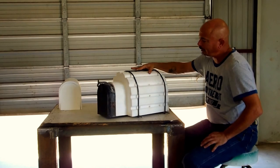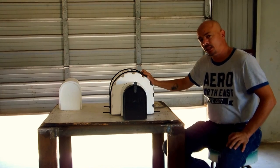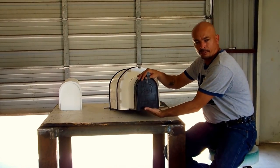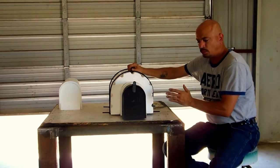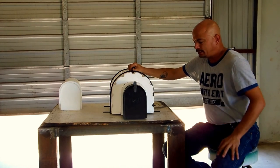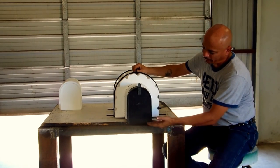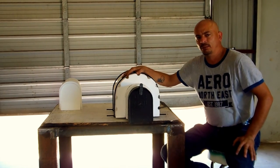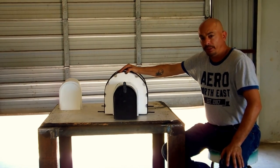We put weep holes in and you can build your brick enclosure completely hollow — no cinder blocks, nothing. There's no need to use that extra material any longer because this will hold your mailbox in place and it won't move. Once this is installed and the three-quarters of an inch of mortar is around the outside of the mailbox, you cannot pull the mailbox out until you take that one mortar joint out. If your mailbox is hollow and you put weep holes at the bottom and leave the void under the mailbox, the air can flow through here.